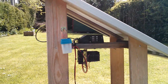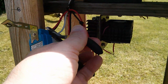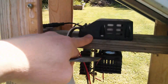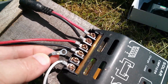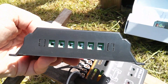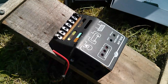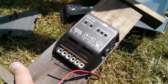What I'm going to do is take this thing apart, clean it up a bit, and just swap out the controller. I think I'll cut this red wire here — I've disconnected the battery obviously. I've got a feeling I put that red wire into the light sensor myself anyway, but I'll need the red and black from the LED module to go into the load output of the new charge controller. The old charge controller has screw down terminals so I put little ring terminals on each of the wires. The new controller isn't like that — it has a terminal block where the wires just poke in and you screw it down. I'm going to have to cut all these ring terminals off; they're all quite corroded anyway. I'm pretty certain this CMP 12-24 charge controller is still going to be okay, so I'll keep it and possibly use it on another project.